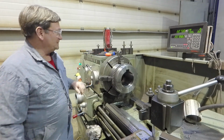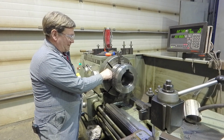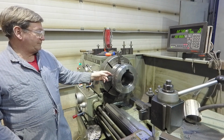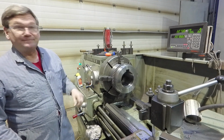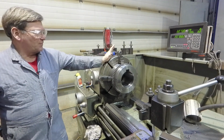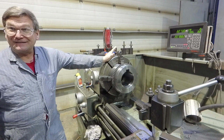To start with, Austin started putting it in, but we need a little bit of clearance here. We need to have 1/2 inch at the back here. Give us a good half to 5/8 at the back, so we've got some clearance from the chuck. We don't need quite that much if we get by with boring this, but we're going to try some boring cuts, at least at first.